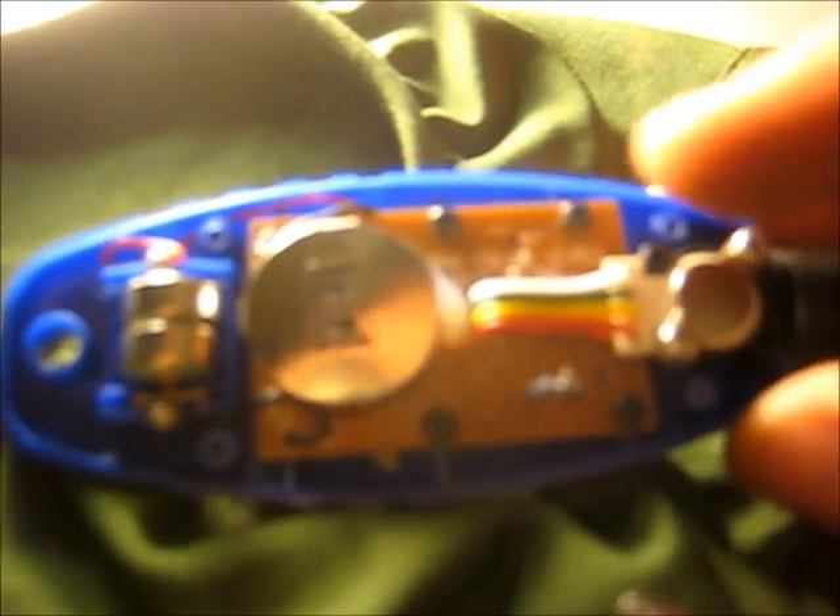You can actually pull this apart and replace the batteries. Most keyring-type electronics are not designed to be pulled apart. So it uses these two button cells for the backlight, and this one is a CR2032 which is the main logic board and everything - it does the readout. The PCB is marked BC-E800-00-A1, made on the 22nd of the 12th, 2008. It's a pretty simple little circuit.